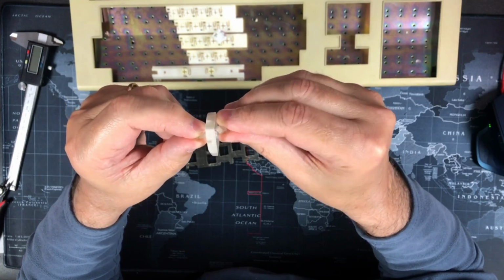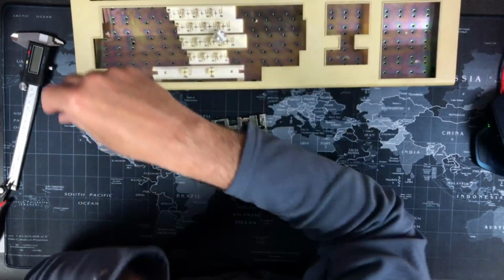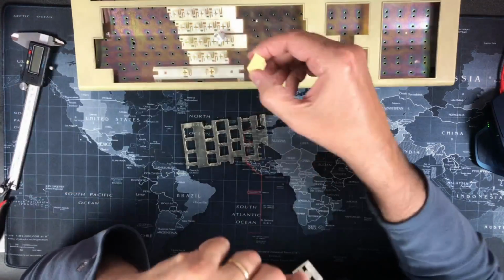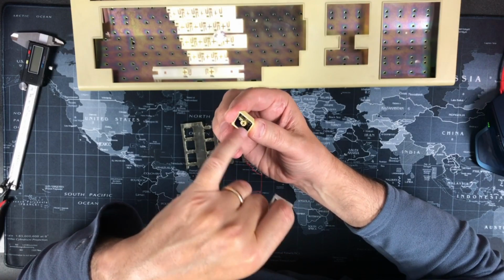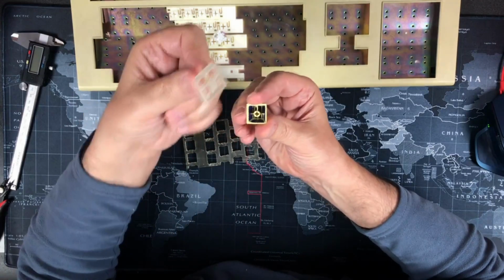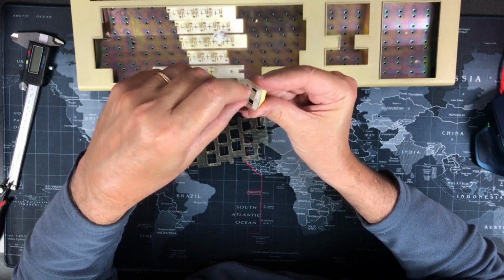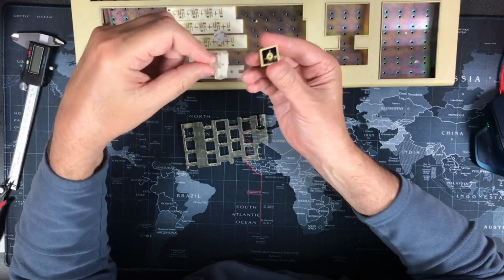Okay, so this is the keycap stem on the jig, and then the point would be, let's see if I got a keycap over here. This is a keycap, but it still has a stem in it. I broke those stems off from my DEC LK. And so this jig is holding the new keycap stem that I want to go in there. If I suspend it down in there, then I can squirt glue in there until it hardens and then remove the jig. That's my idea.